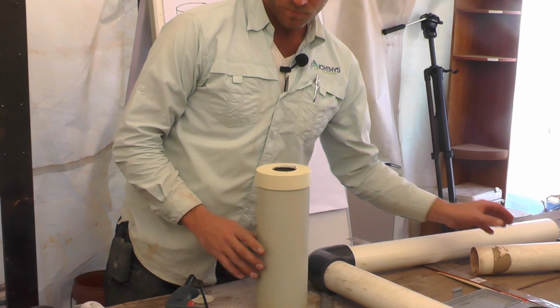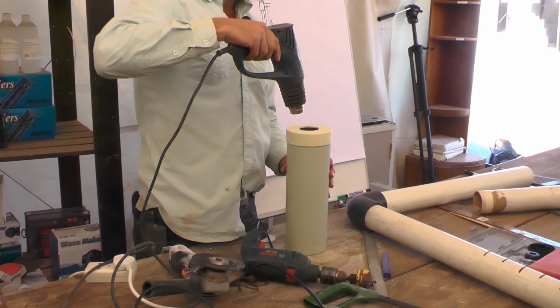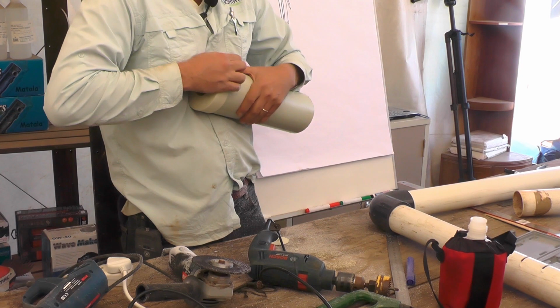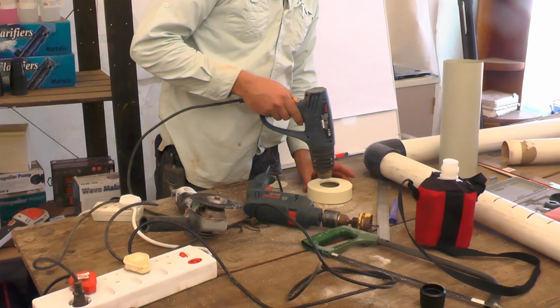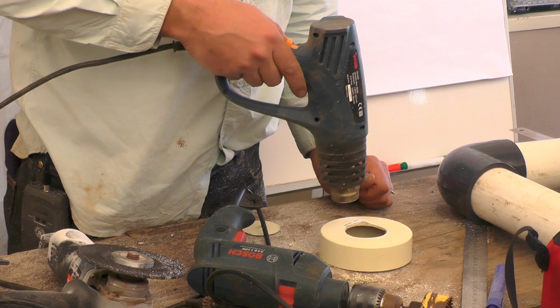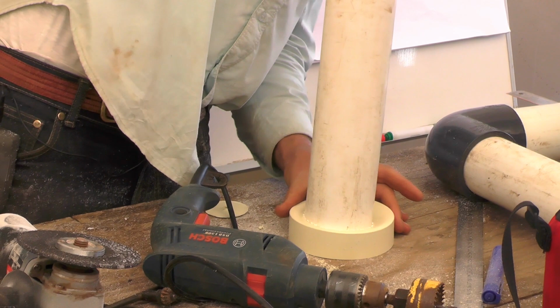All right, can we get some water again? We need that just to set it. And just one other piece of advice is actually take it off before heating it. Not that it bonds, but what will happen is this end cap will expand and then it will become too loose. Okay. Obviously not, don't overdo it. Now my 75 mil pipe pushes in. Get my water.